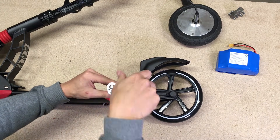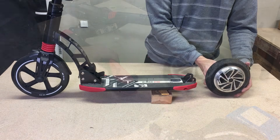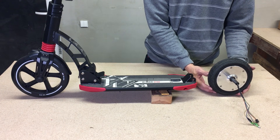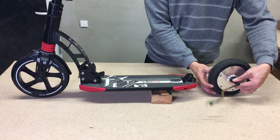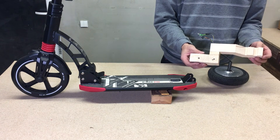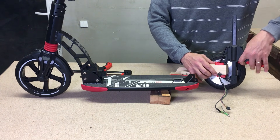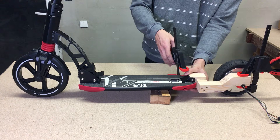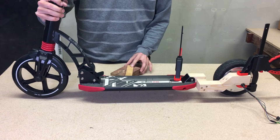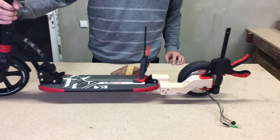I removed the rear wheel with all suspension because I won't use it anymore. The idea is to make some kind of bracket to hold the hub motor in that position. I took 4x4 centimeter square wood pieces and made this temporary rear wheel bracket. I used wood because it's very easy and fast to work with, and later I'll replicate this bracket with 4x4 centimeter square steel tube.